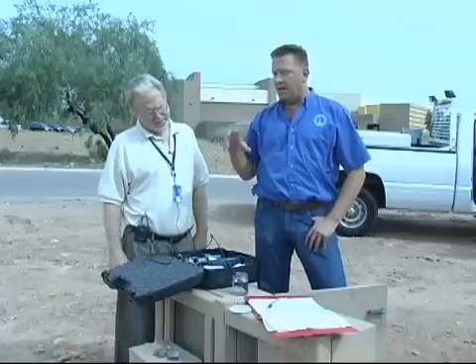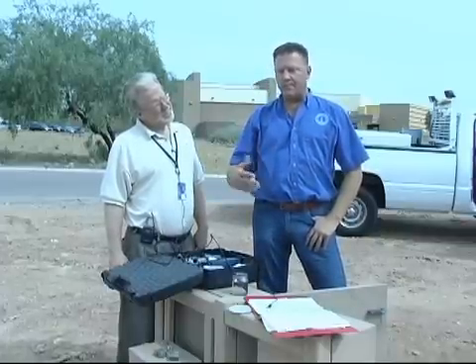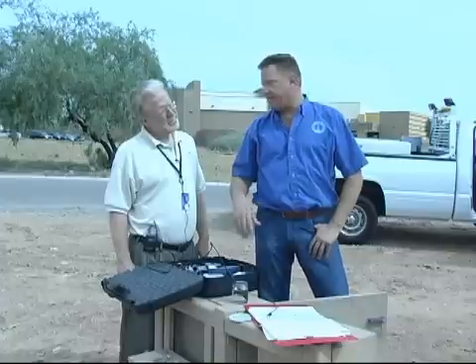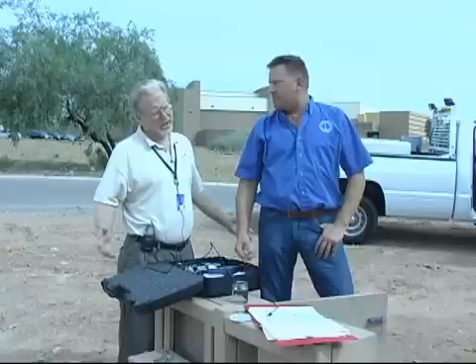This will happen in 10-minute increments until the well has purged through the well volumes. At that point, we'll take our last sample and run it in duplicate because we're running standard methods 2510, so we're going to run a duplicate. In our case, we do it every single well because we don't do that many wells per month. The method doesn't require it daily, but we do it, so that's fine.